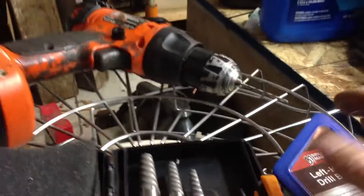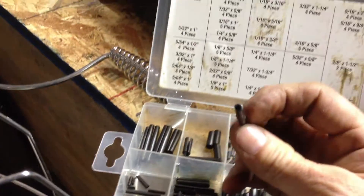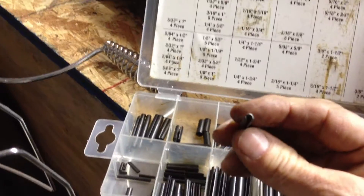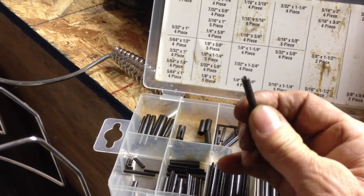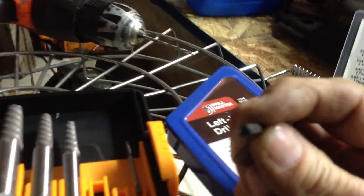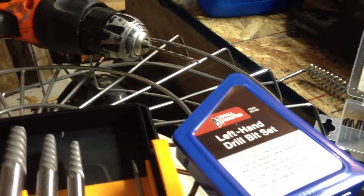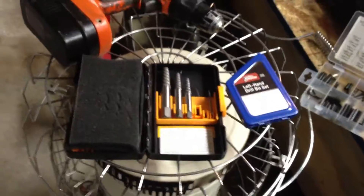These are from Harbor Freight — easy enough to get a hold of. I just found a roll pin in a roll pin set that was pretty close to fitting tight in the threads. I wrapped one or two layers of tape around it so it would just thread into the hole. Then I found a drill bit in the set that fit into the center of the hole, and that put it perfectly on center. I don't know why I never thought of that before — that's the first time I've ever centered a hole doing it that way.